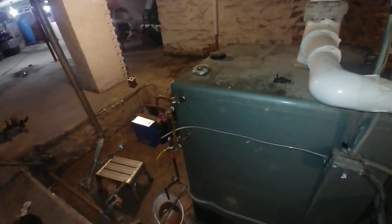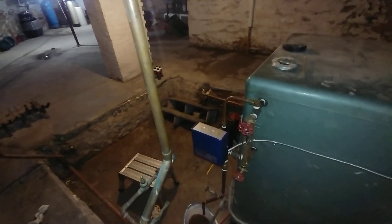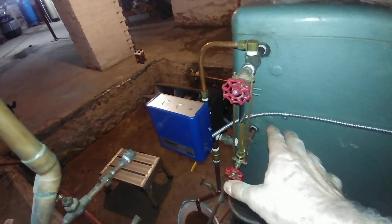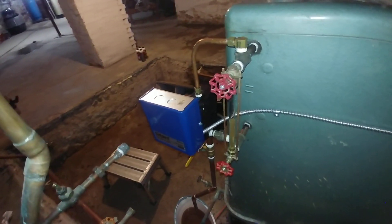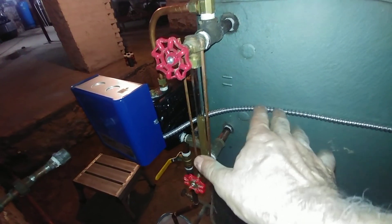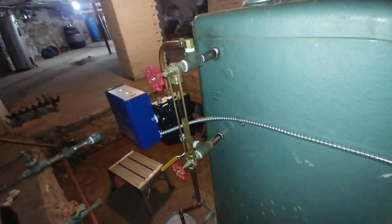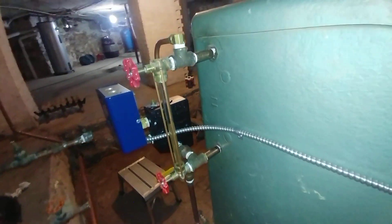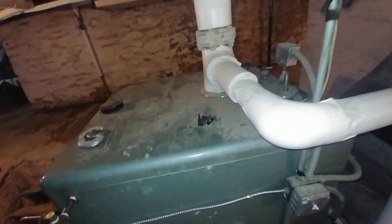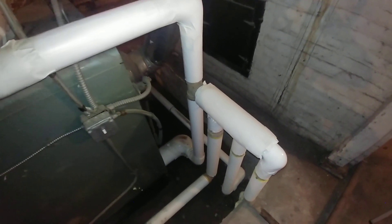What was happening is they had set the 47 fairly high up and jury-rigged some offset fittings to keep it constantly flooded. We believe it was generating a lot of wet steam because there wasn't enough separation — the steam chest was barely adequate to separate the steam from the hot water. We hope that by keeping the water level at its design limit we can produce much drier steam with this old boiler.